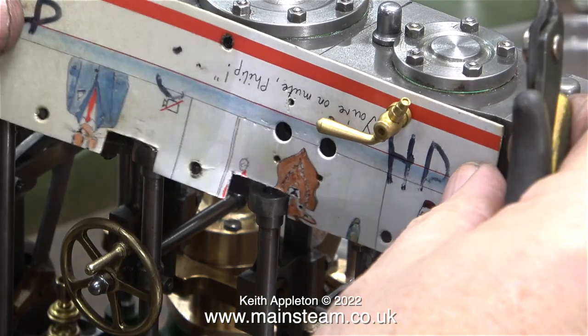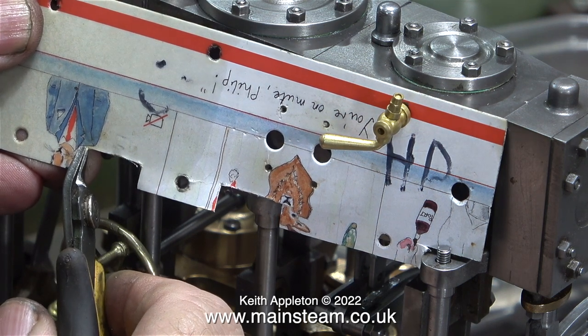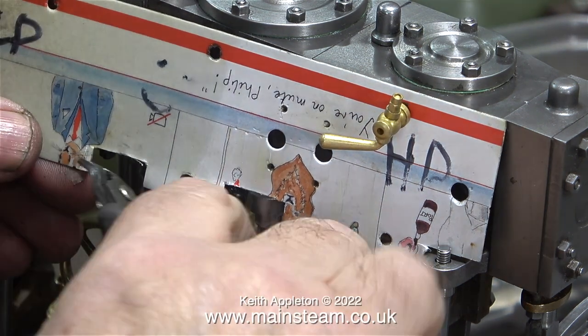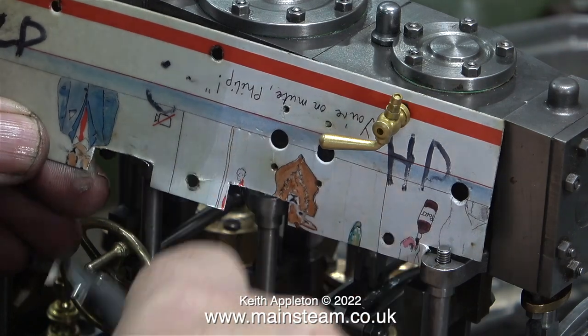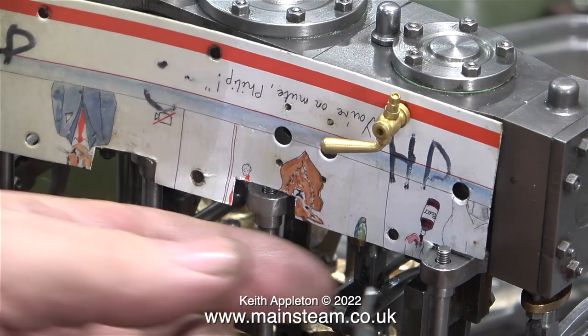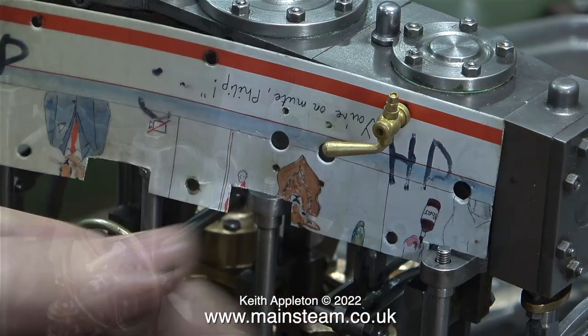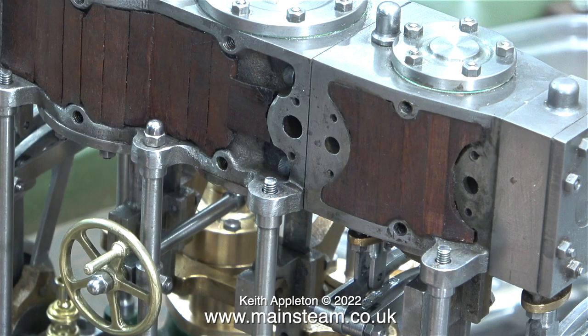I made some templates a while back using two pieces of old Christmas card. The length and width is fine and the holes are in the right place, but the bits of the template that fit around the lugs where the engine mounts to the standards are a little bit too small, so here using a pair of side cutters I'm making them a bit bigger. The holes for the drain cocks also need to be a bit bigger. What's holding me up on this job is I don't have any cylinder drain cocks with a suitable 5/32x40 thread.